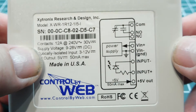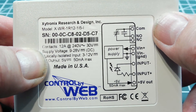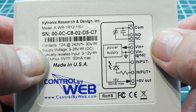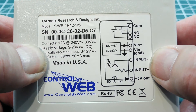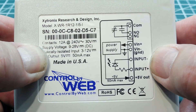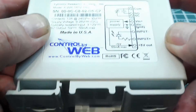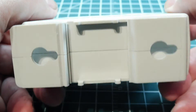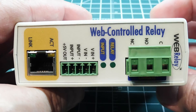On the side you can see a schematic showing the relay contacts — normally open and normally closed — the input voltage, supply voltage VIN plus and VIN minus, opto-isolated input sensing pins, and the 5-volt output for your sensor. On the back you can mount this using screws or a DIN rail. Next we'll power the device up and check out its operation.